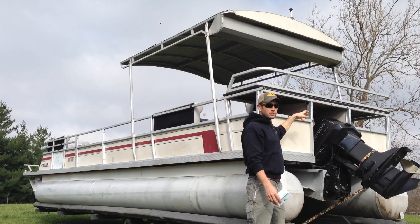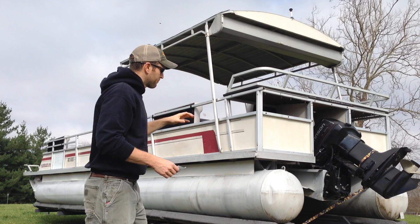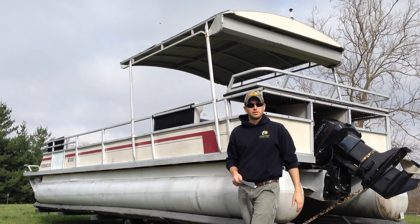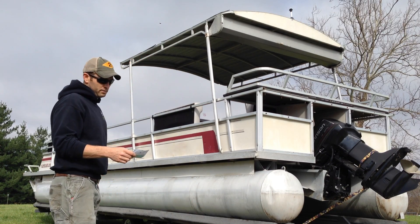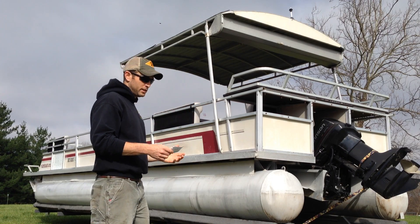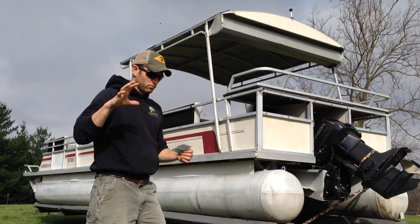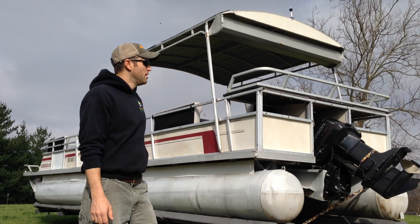Stripping off the 88-horsepower engine and actually mounting an 11.5 kW electric motor that's going to mount on top of where the engine used to be. So this will all look the same — the lower unit and everything will be what's in the water; it'll just have an electric motor on top instead of an engine. That motor can surge up to 20,000 watts, which is about 27 horsepower for 30 seconds. It's a 72-volt electric motor, so at the rated 11.5 kW — the 15 horsepower rate — it's about 160 amps coming out of that battery bank, so it's pretty substantial.